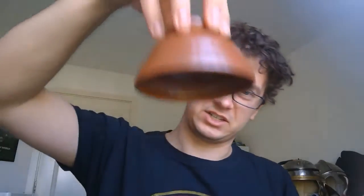It has a very shiny, hard outer surface and this is called a vitreous slip. So it's not actually glazed. What's happened is they have dipped it into a slip, which is a liquid clay, and then fired it at a sufficiently high enough temperature that the outer surface vitrified — basically almost turns to glass and becomes a shiny outer surface.